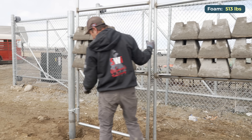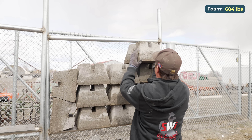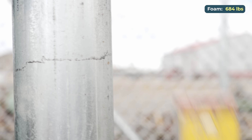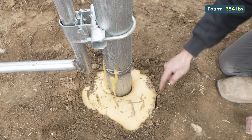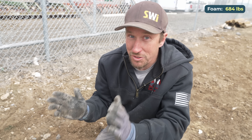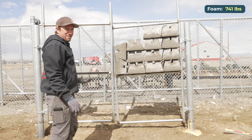As I shake it you can see there's some weight there — it's not failing but you can kind of see everything move. Over on the concrete side I can shake it and we don't have a lot of movement there. There's some definite sag now; it almost looks like the gate frame is just out of square from all the stress. About five-eighths of an inch every two feet. It's not cracking and shifting, but the whole thing is moving, and you can see where it's pulled away from the wall of the hole from the discoloration between what's been exposed to the sun and what hasn't. It's not an extreme failure yet, but it's on its way out.